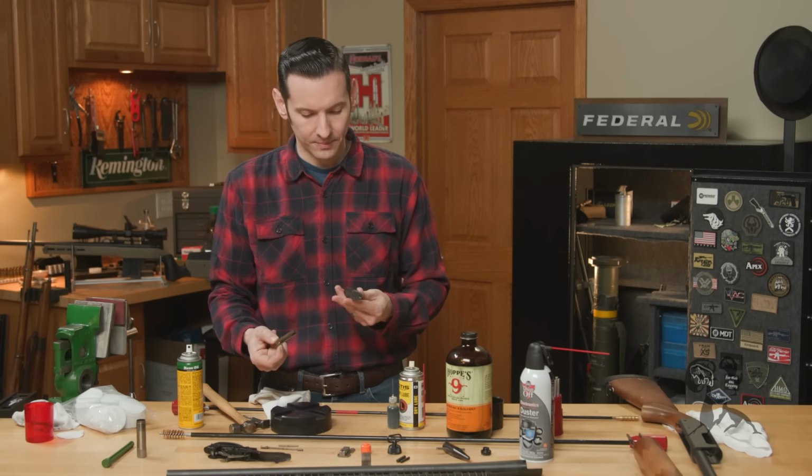If it won't go in, pull this assembly out just a little bit, and then it'll go in. So push it in, and you'll feel the action bar go past it. Now we got to jump to the other side and push it. I'll try and do it so you can see here. Alright, it won't go in, so let's come out just a hair, but not so far that we go past this side. Push it in, and then once you feel it go in, everything will drop into place. So you got to push in the ejection side, go in a little bit, push in the opposite side, and then you can go in the rest of the way, right? So that's how you get these back in.